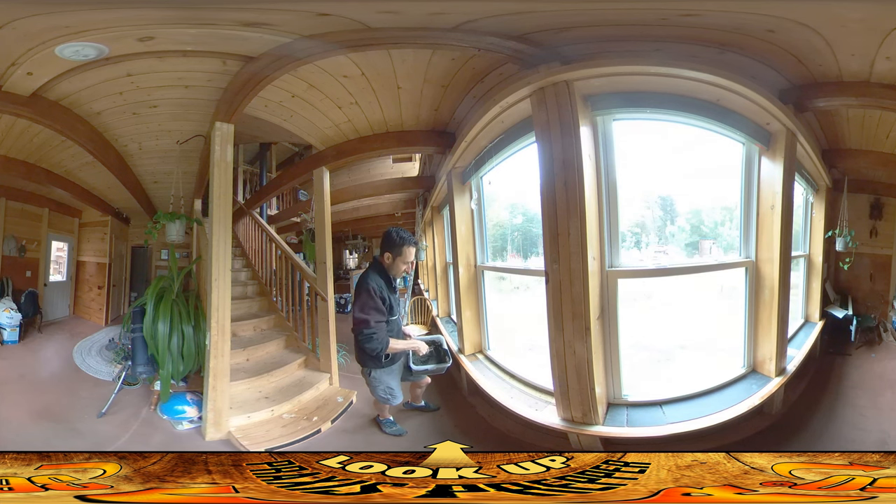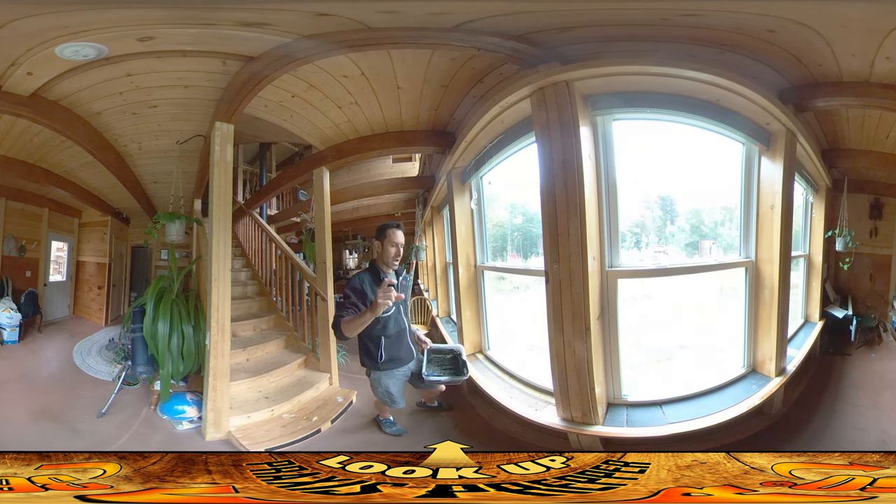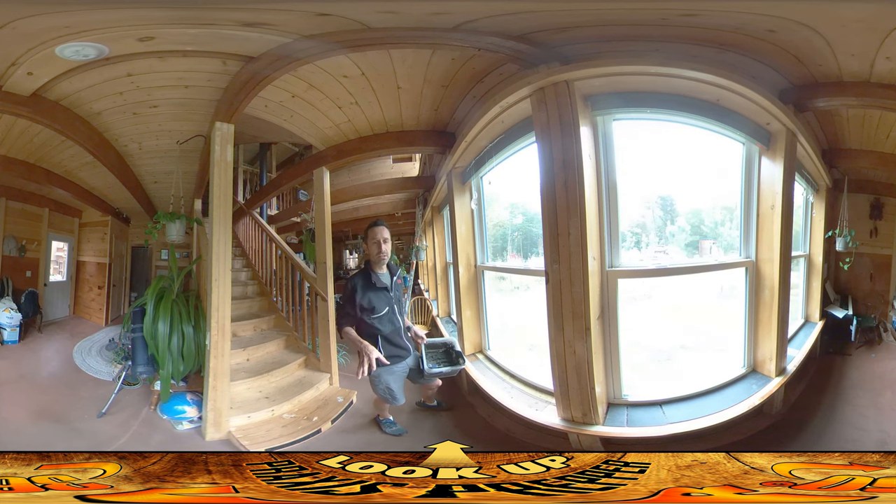I've got a little bit of concrete here that I've been mixing up. This is three large yogurt containers — an official measurement here in the United States — three large yogurt containers full of S-type mortar mix, which is mortar without any kind of gravel in it. Two large yogurt containers of a reinforced cement that has gravel in it. Then one small yogurt container of Portland — that's pure cement — to harden things up a little bit more. And then four small yogurt containers of black grout, the same black grout I've been using in the bathroom and anywhere I've already done stone work, just to darken the stuff up so it looks a little bit better — and to use it up.